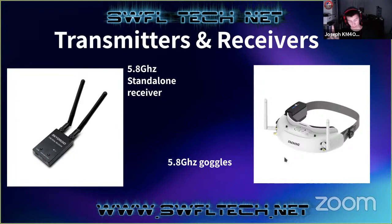And that's very important, because if you're flying a model, especially an airplane or a quadcopter, and you lose your control signal or something breaks and you're a long way off, that recording of the last scene before it goes down too low and you lose signal, if it's going to crash, that recording could be what it takes to actually recover the model. You can see where it was facing when you lost reception. If you don't have a DVR, then you kind of just have to go off memory. But having a DVR for a long range mission or something like that is very important.